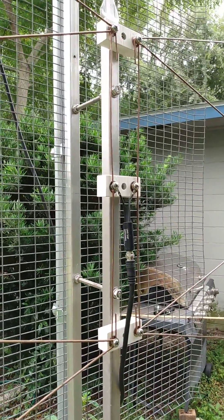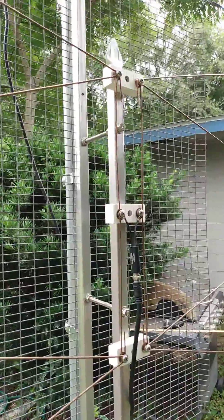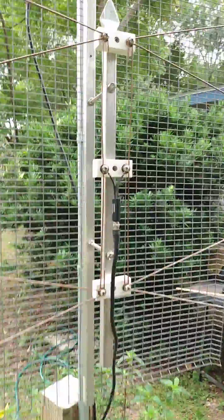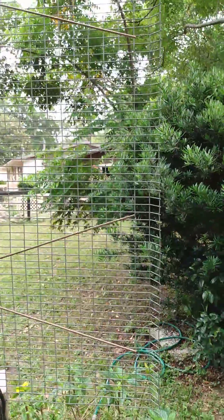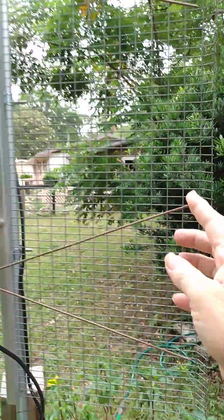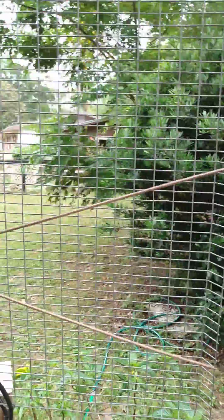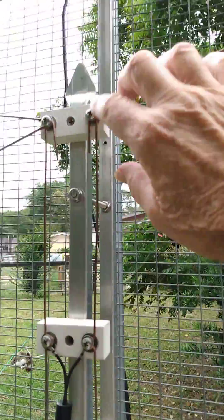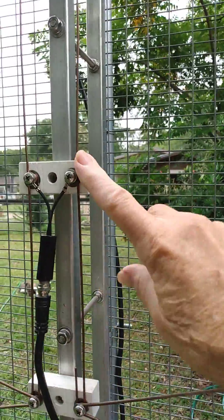The 12 by 15 inch bowtie antenna, two bay bowtie antenna, mounted on a reflector. Why is it a 12 by 15? The elements are 12 inches long — from that point to this point is 12 inches. The separation between the bottom and the very top is 15 inches, with the feed point dead center.